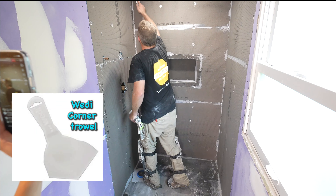Tomorrow I want to set the shower floor and get this back wall up. I always recommend doing your shower floor first — it depends on what you're using, but for most tiles, two-by-twos or whatever, I recommend doing that floor first. You want to keep that expansion contraction joint around your perimeter of your tile, and then the wall tile will overlap it. The grout joint on the vertical surface meeting the floor tiles looks much better than looking straight down at a grout joint.